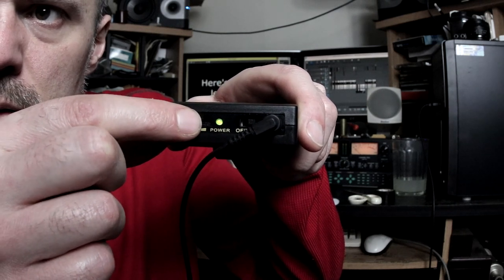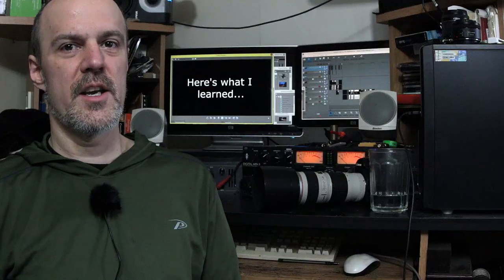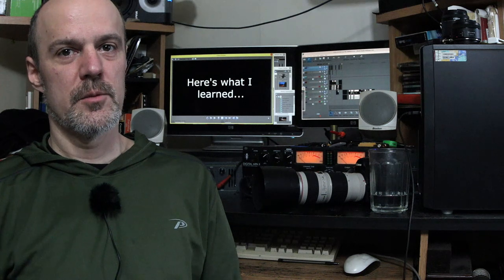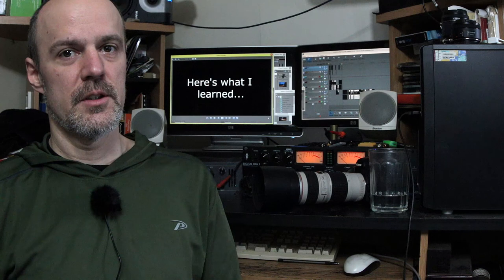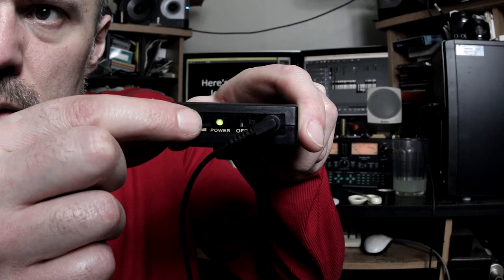You should get about 8 to 10 revolutions depending on your finger size and how far you turn the wheel. 4 to 8 seems to be the sweet spot. 1 and 10 seem to have hiss, so let's try to stay away from the extreme ends of the dial. I did the video at about 3 or 4. Set the transmitter volume to 4 revolutions.